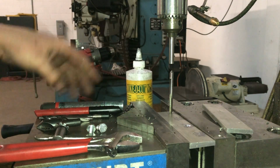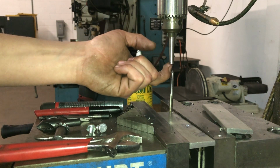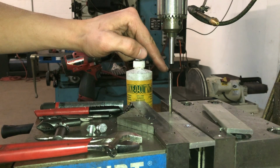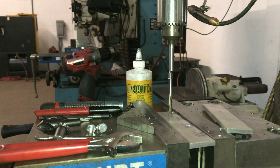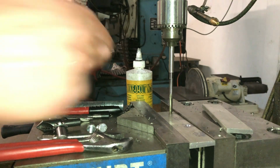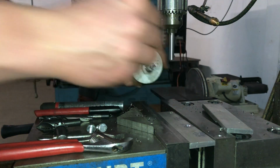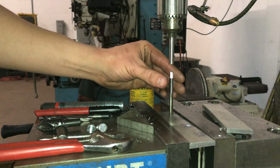So now, what I do from now on is I took this piece of steel, I've drilled a center drill pilot hole into one end after I faced it, and then on my taps that come to a tip, I just simply hold this down over the tip so that my tap is nice and straight, and then I start cranking with the adjustable. Because you could use a tap handle, but this gets the tap straight in the hole every single time. But first, of course, you're gonna want to use some cutting fluid, so I'll put some on the tap. Now we can get jiggy with it.